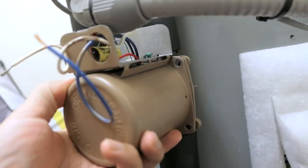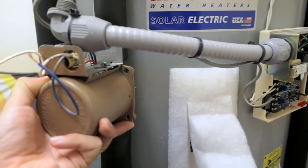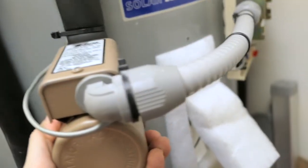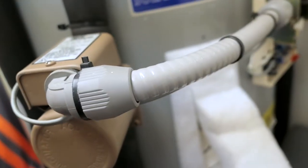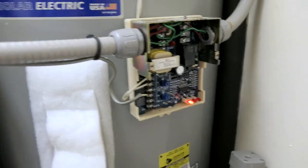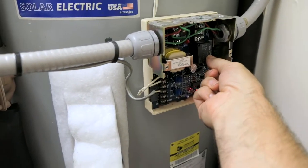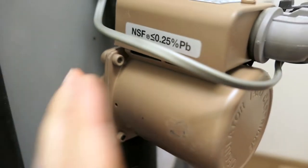Now that we've got the new one, it should bolt right on where the old one was. I'm going to go ahead and reassemble it and turn it on to see how it works. The new pump is back on — it was actually not hard at all. There are just these four bolts and it comes right off, along with disconnecting the power. Let's turn on the breaker, we've got power to the controller, and putting it on auto — there it goes! I can hear the pump moving water.